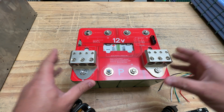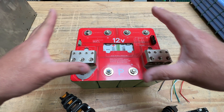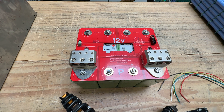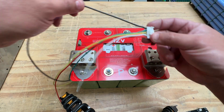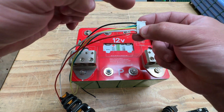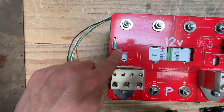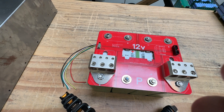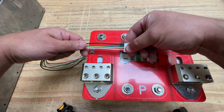Just in case you don't know, all our batteries that we build here use a PCB board on top, and we put a connector with screw terminals, which makes it really easy to install a balancer. Here is the cable that comes with the balancer — the black one is battery negative, the red one is positive, and all the center taps are in order. In our battery it is labeled B-minus all the way to B-plus, with all the cell center taps in sequence.